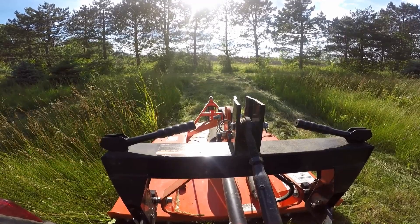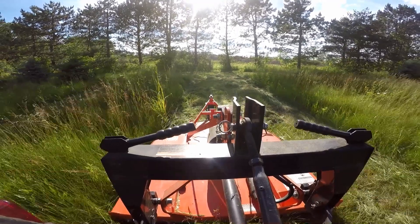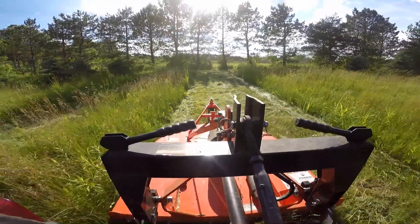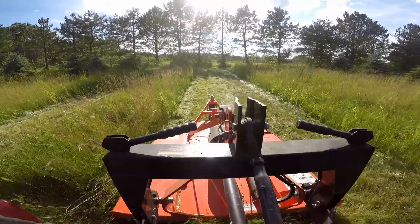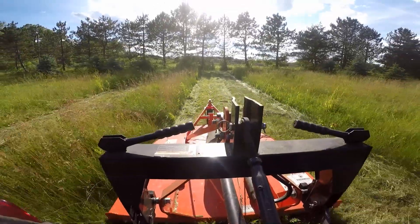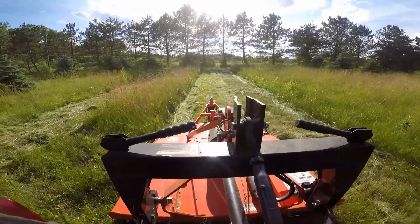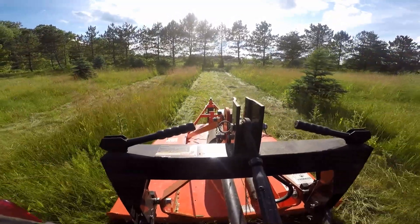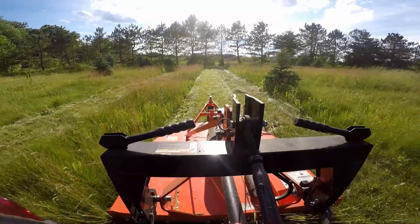According to the information I ran across, the claim was that a lower vehicle speed or ground speed combined with a lower PTO speed or lower blade speed provided a better cut. I would agree with the lower vehicle speed, and I think that's evident even with a push mower, a riding mower, and probably a rotary cutter as well.